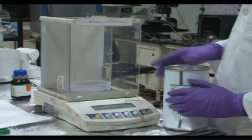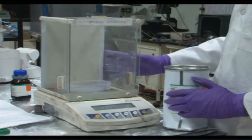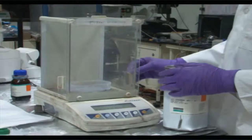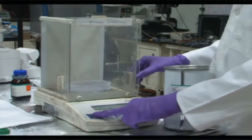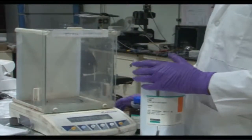Again, the curing time is realized by heat treating the PDMS to a higher temperature, okay, and so you can make the curing time shorter and shorter based on the amount of heat that is flowing into the system. Heat is like a catalyzer which would be able to cross-link the resin matrix and the curing agent, the premixed resin matrix and the curing agent. So you basically measure and try to zero the weight, and then you can pour both the components, okay.